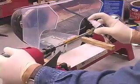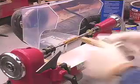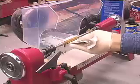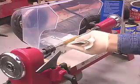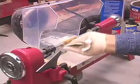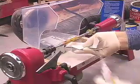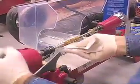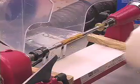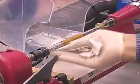Now we're going to accelerate and dry it, just to make sure it's dry. We're going to turn the lathe on, hold up a little bit of heat, and after a couple of seconds, you've got a completely dry blank. We're going to continue applying, spreading, and accelerating and drying on several applications until we've built up the CA glue to a nice thick level. After that, we're going to sand to a final finish.